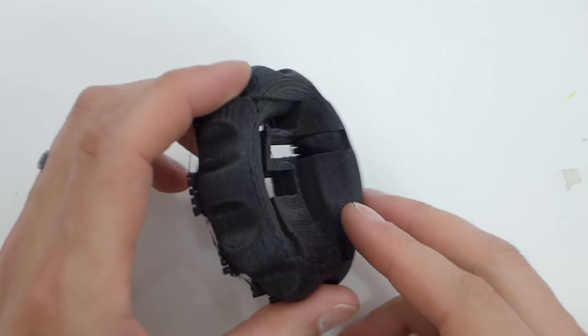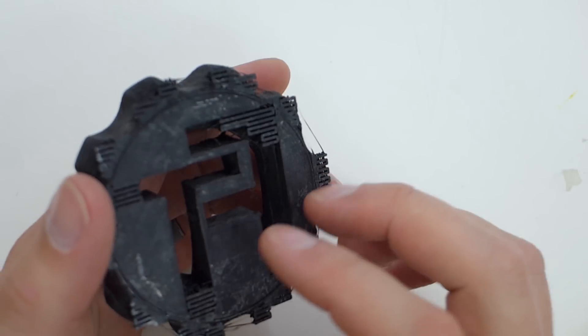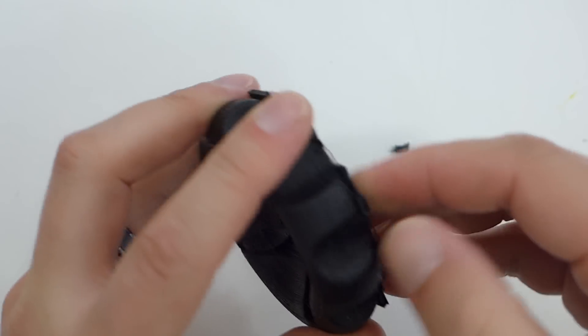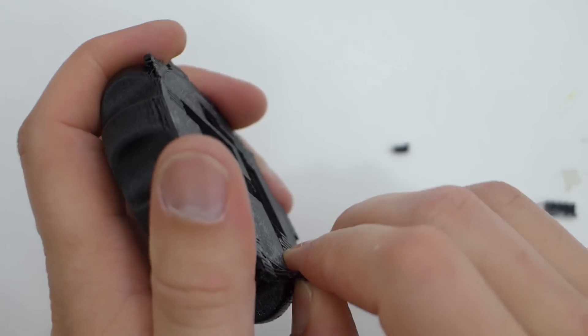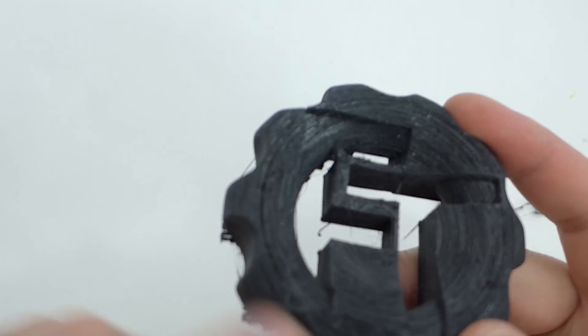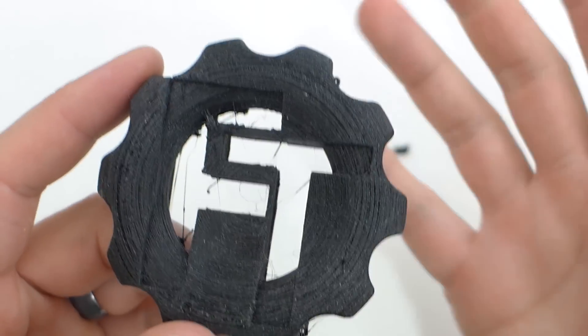Then I have my MakerCoin, and this turned out okay. Right after the Moai, I started to see a little bit of fishiness with it — kind of like it might have been popping, like it had some water in it. It started out decent but then after a while just ended up going to kind of crap. Pulling support off of flexible filament is tough — I usually need side cutters to get nice and close and give it a little snip. It's pretty tough no matter the flexible filament. With PLA they come off without a problem. I might just need to change up my settings for flexible filament support. Either way, it did fairly well. It looks a little like it was maybe too hot, or there was moisture in the plastic, plus there's some missing parts, so it seems like there might have been moisture inside the filament.